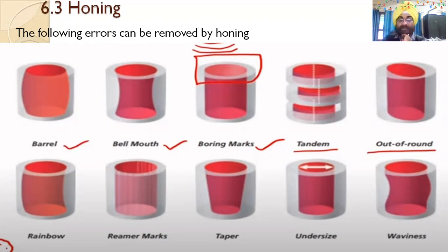After drilling, reaming is done, and then comes the finishing process — but reaming gives slightly less finishing. Honing is a much higher level of finishing job. Errors corrected by honing include: taper — where a job has become tapered and needs to be made parallel; undersized bore; size deviation within the limit of 0.1 to 0.25 mm; and waviness — all corrected by honing.